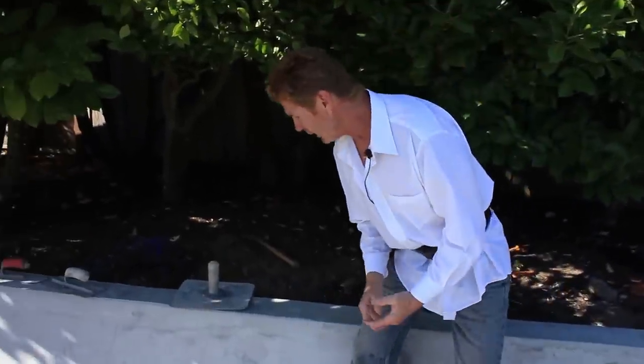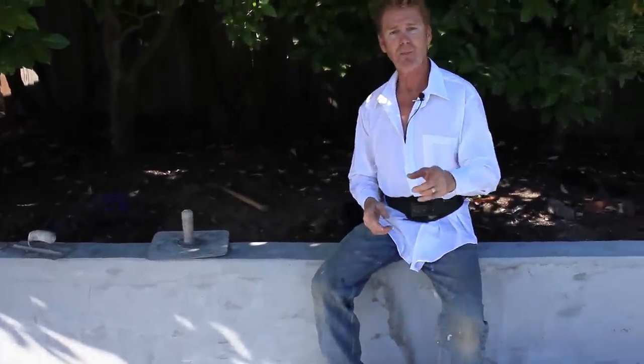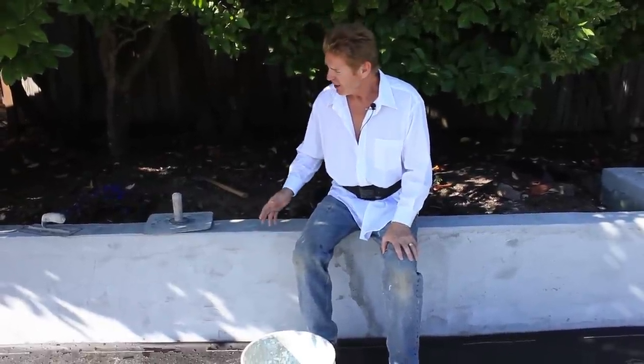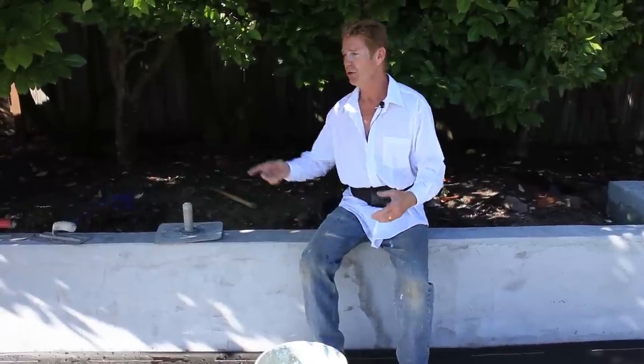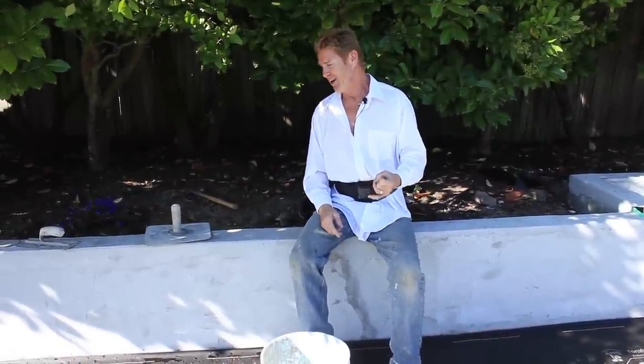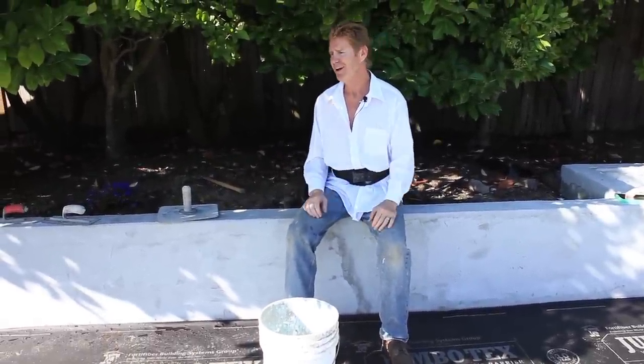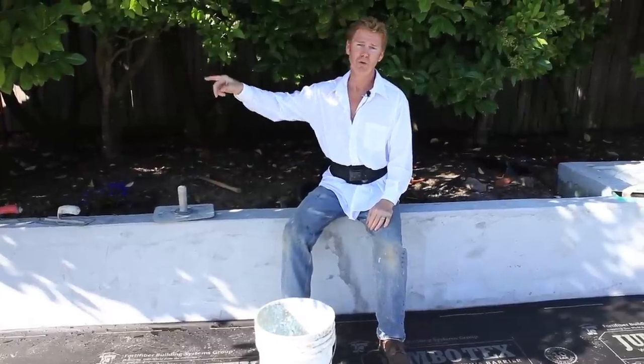Jay will put the camera on a tripod and we'll show you this one small section, and when we're done with everything we'll show you that too. I'll give you tips on corners, clean edges, and how to apply it the old school method. I personally prefer the modern pre-mixed bags where everything is ready to go. Without lime, the mix is not as durable, flexible, or dependable — you've got to have lime if you're going this old school route.